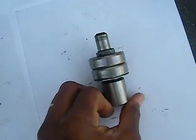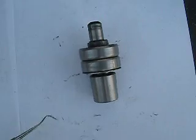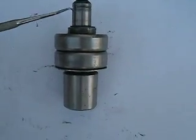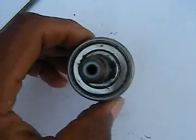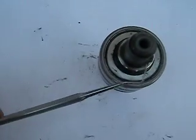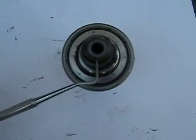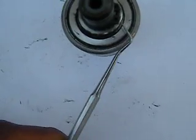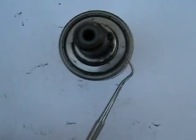So that was able to come out there, and there's the shafts for the two bearings that BE has on their swivel. This little groove you see in here on the shaft is the position for the O-ring. This face here is where they put one of the mating faces for the mechanical seal. There's another circlip that you have to remove here in order to get access to the bearings.